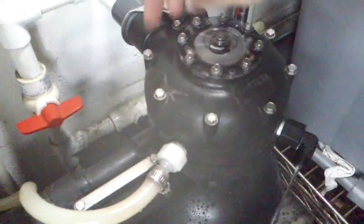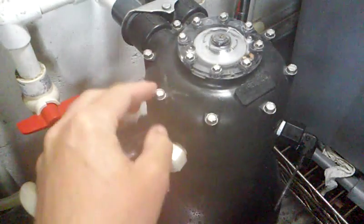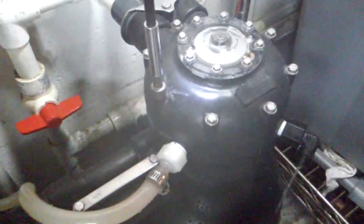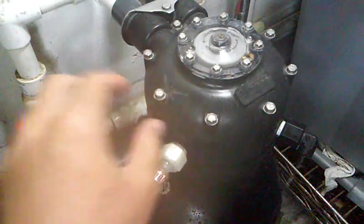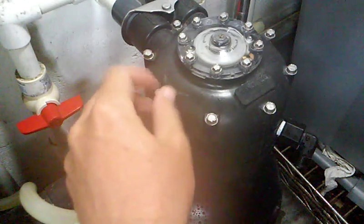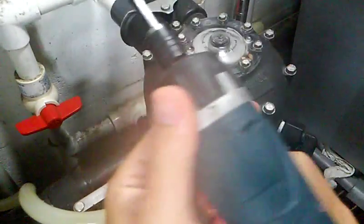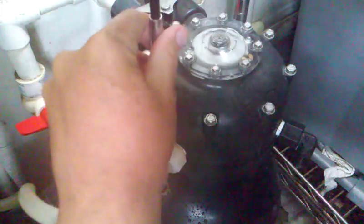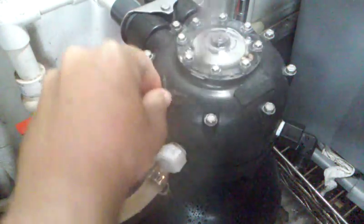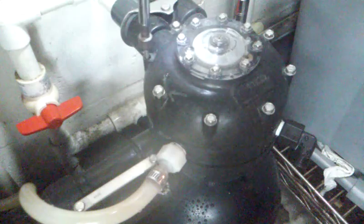There are eight bolts that you want to take apart in order to get the unit head disassembled. I have a problem with one bolt — I stripped it. I've taken this apart 30 or 40 times in the last few months and eventually this one stripped out. Be careful when you put these bolts back in — don't use too much pressure on your drill. I made the mistake of having it on the strongest torque; I've set it to about two-thirds of the torque now. I'll have to take the stripped one out manually, and the rest will come right out.